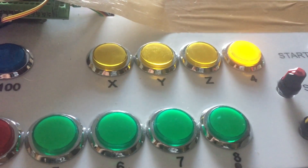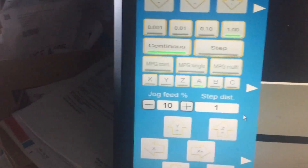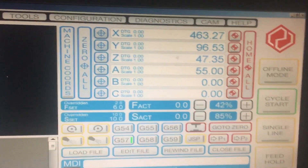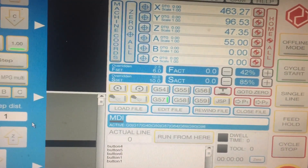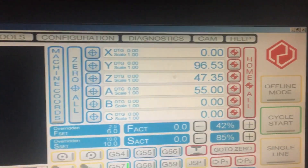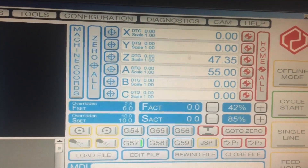I'm using ticks, which are the smallest amount of time — it's like 25 million ticks to two and a half seconds, so that's quite a big time space. What I've got is: if I press the X button, X select, it'll select X on the screen — same for Y, Z, and A. But if I keep X pressed for three seconds, it will reset the X axis. And there it resets — it zeroes out the axis if you hold that button for three seconds.